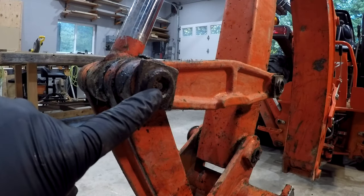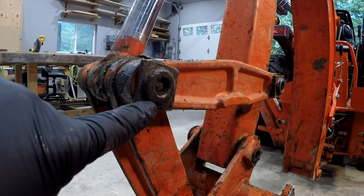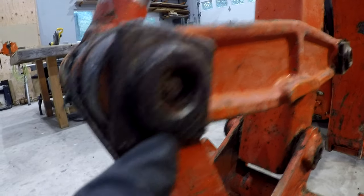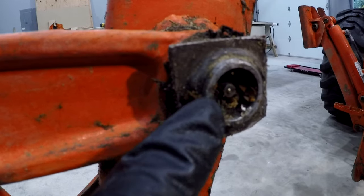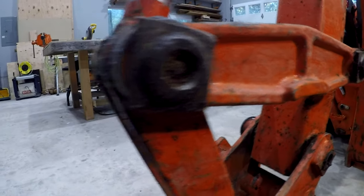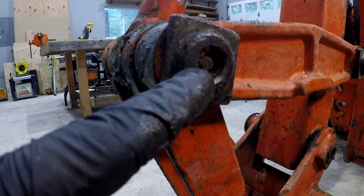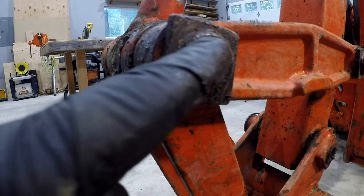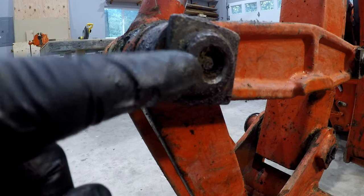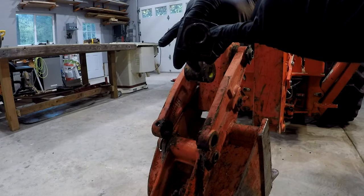Alright. This is the pin, and the Zerk fitting is inside of this recess. You can see how this is all smashed - this ring has been smashed down by my brother with a hammer. This ring should look like this ring - nice and raised - so you get the grease fitting tip in there on the Zerk. My brother decided to smash on this with a hammer when he replaced this part. So I'm going to pull this pin out, clean all the dirt out inside of there, pull the Zerk out, grind out this banged-over metal, and then put this back together so that I can actually get the grease gun in there when I need to.